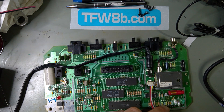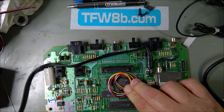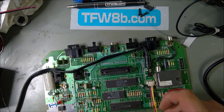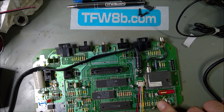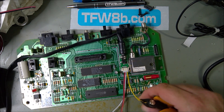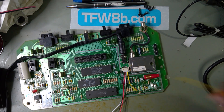You really should cut the cables short. We've seen people wondering why they've got video noise and they've done something like running wires over the top of these noisy chips here. So just keep the wires short. The first one we'll do is the actual composite pickup — composite pickup goes down here. Keep it nice and short like that.